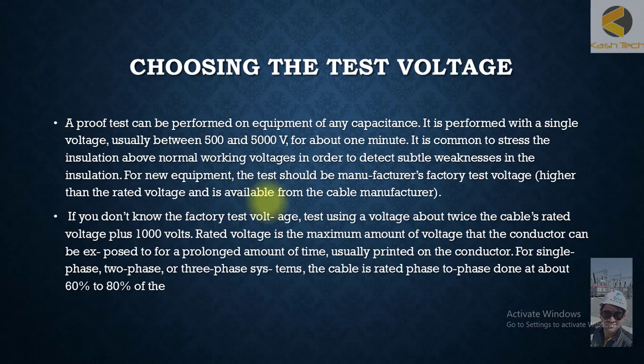For example, during the induced voltage test performed on a transformer, the test is conducted at much higher than rated voltage — almost 1.5 to 2 times the rating, as per the manufacturer's recommendation. We choose to perform the same test at 80% of the factory test value. However, this high-voltage test will never be repeated during the life of the transformer; going forward, only megger testing at voltages equal to or less than the line voltages will be performed.